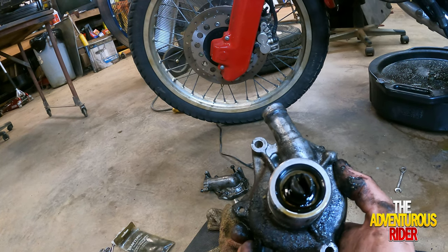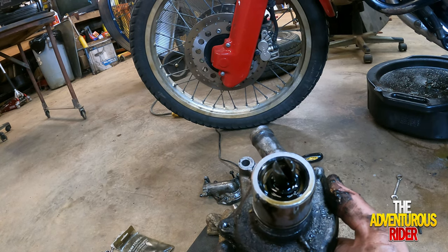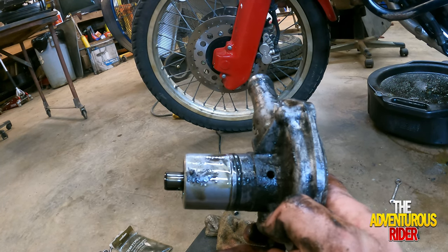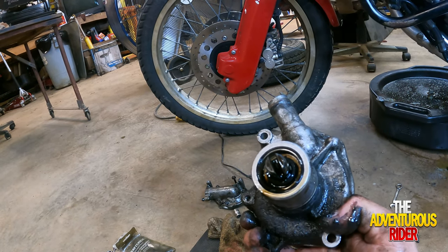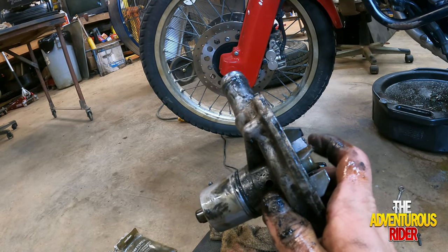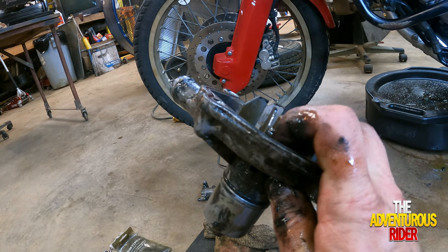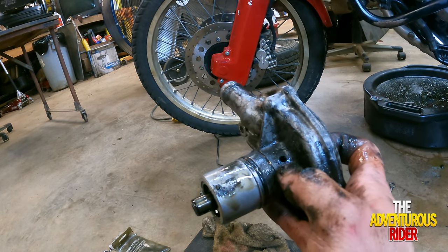The oil seal that needed replacing is the one you can see right there in the groove. It was allowing oil to come out of the weep hole right there, letting me know it needed to be changed. There's the weep hole you need to look for in order to see if that oil seal is actually loose. I also noticed in the book that there's another seal right in here keeping water from leaking into the same weep hole — so it's kind of a two-seal design with just one weep hole.